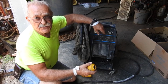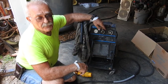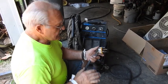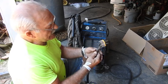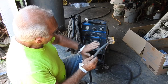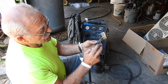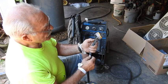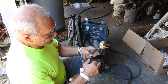I think the machine's got a couple of years on it — it's got a little wear and tear, but it's got a protective cover and it's actually a pretty good machine. When you download the PDF, go to page 15 — that'll give you the wiring requirements. I'm not going to trim these off because this is only temporary. Those instructions will show you that if you're using single-phase power supply, make sure you use the factory-supplied SO cord — factory-mounted on one end with bare wires on the other. Use the black and white wires for 240-volt power supply, the green wire for ground, no neutral, and just tape off the unused leg.